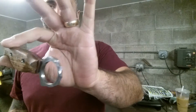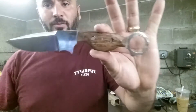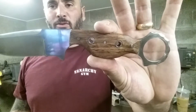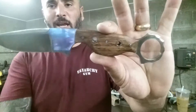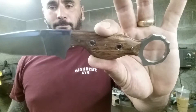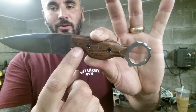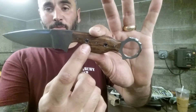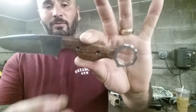I cut it myself for bookmatch. The mechanical bond for that is 125 titanium pins that I peened, and 250 titanium tubes that I flared, chamfered, and epoxied up first.